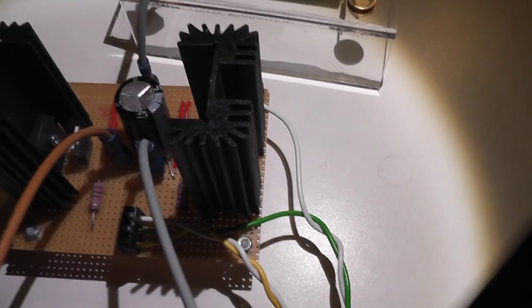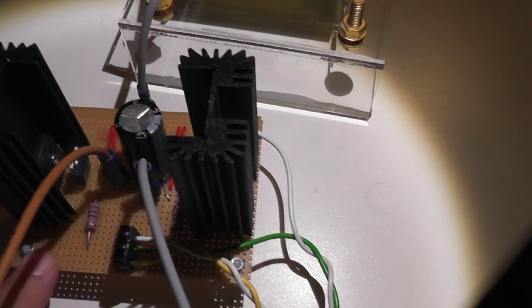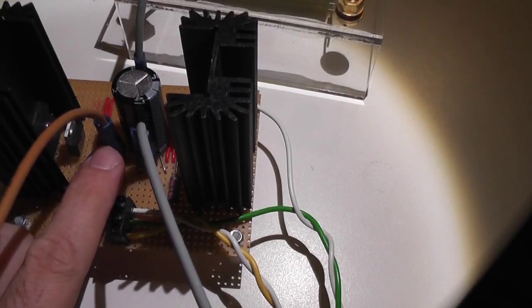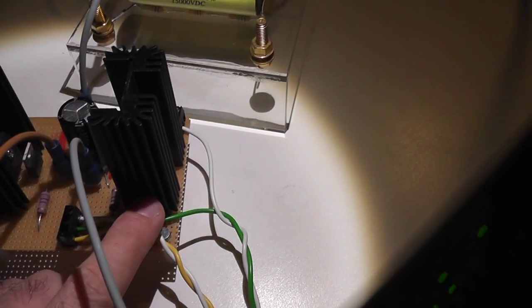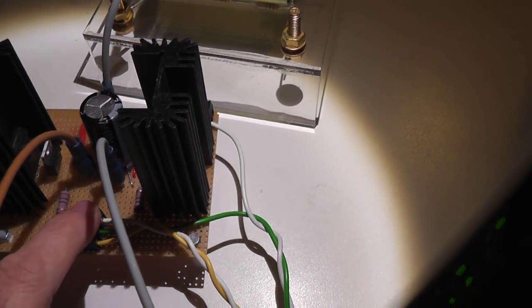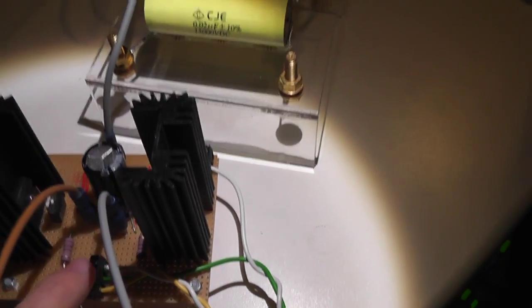This is my amplifier side — you see the two MOSFETs, the IRF-P450. It is not a very powerful one, only 190 Watt each side. You can see here: my positive rail goes to the high side on the left side, my negative rail goes to common, and here you have my input sides — the high side goes over here and the low side goes to the second MOSFET. There is a capacitor in the middle to compensate for ripple on the line.